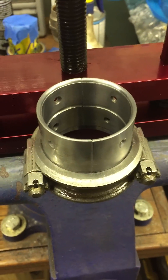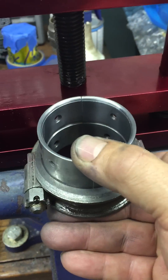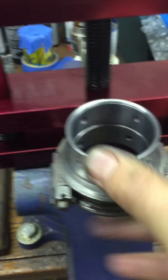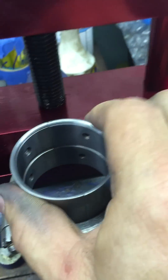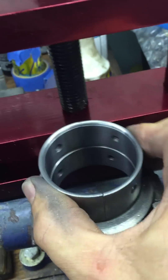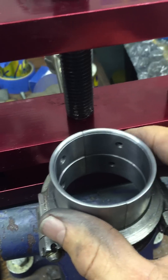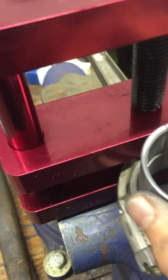I'm going to try to describe a little bit of the challenge of fitting these full floating bearings. When I put these two together, notice how tight they are — they won't even slide up and down inside the rod. I've got a rod in the rod vise here, and I'm trying to see if these two will fit. They're really tight, so they're obviously not going to float around the bearing.